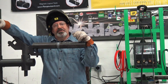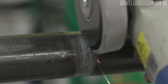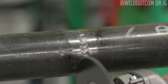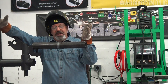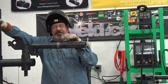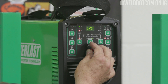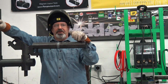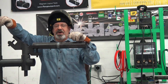That was my fill pass run, so now I need to buff this off and come out here to make sure I take mill scale or cosmoline — whatever's on the pipe next to the beveled edge — get everything cleaned up, and we'll do our cap pass. For me, I'd like to let this cool off a little bit, decrease the amperage, and go back to a smaller wire. I could have put the fill pass in with the 3/32, but I was trying to avoid running too hot of a pool, so I grabbed the bigger wire.